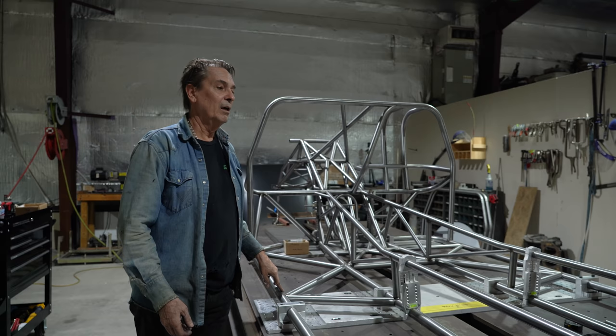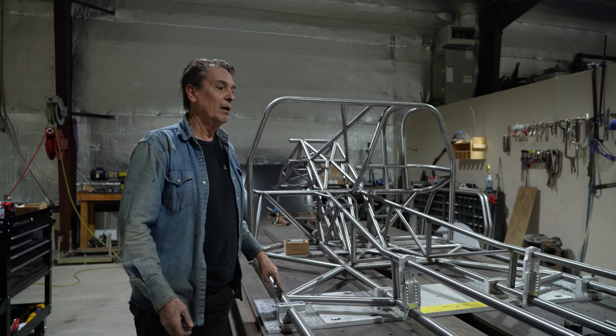But without having the carbon, we don't know where that dash bar goes. And since we don't have A-pillars with this car, we have to simulate where they would be, then run the A-pillar bar and tie it into the dash bar. There's a roof bar that goes across with X bracing up in the roof, and we can proceed from there. But until we have the carbon, we're kind of at a standstill. We'll see you next time.